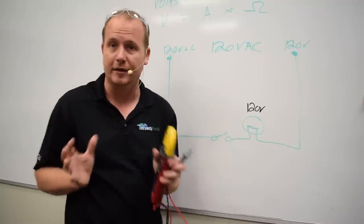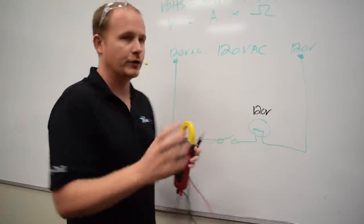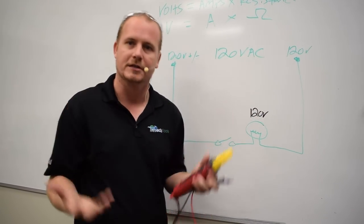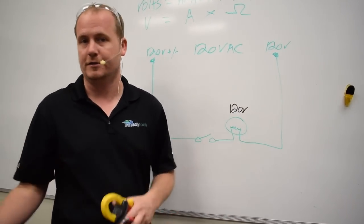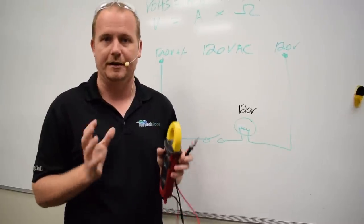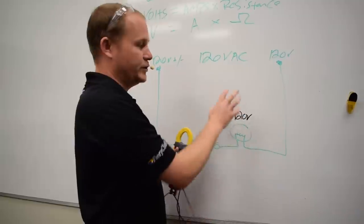And if there's only one thing you take away from this video, that's what I want you to take away. You want all of your circuit resistance to be in your load as much as physically possible. And the load is the part of the circuit that does the work. In this case, it's a light bulb, it's your compressor, it's your condenser fan motor, it's your heat strips, it's whatever does the work, actually accomplishes something in your system. That is the load. And you want the fully applied voltage to go to that load.